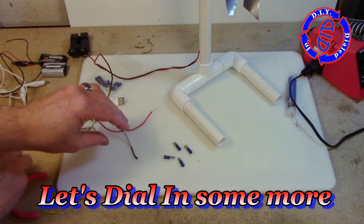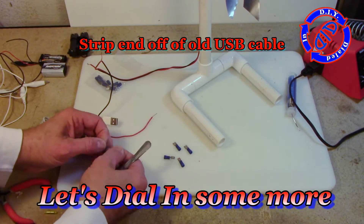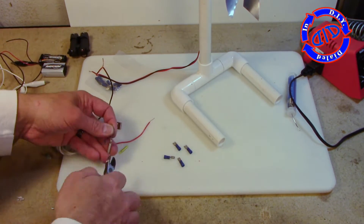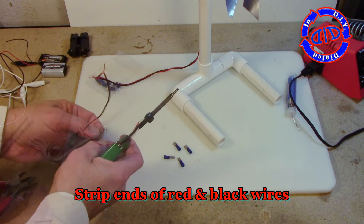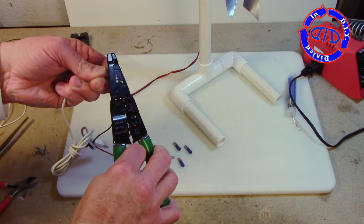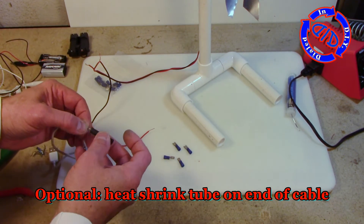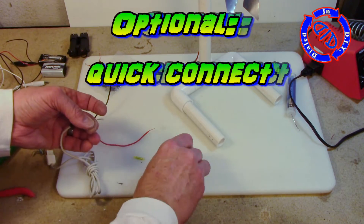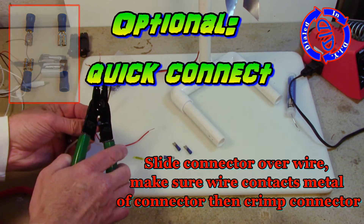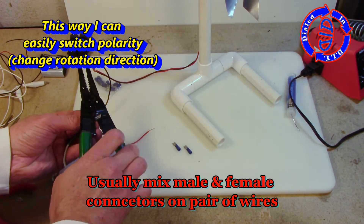I still think we can get more out of this build. While I want safe wiring, I also want the flexibility of using multiple power sources. Instead of just a battery pack, I'm taking this old worn-out USB cable, removing the sheathing off one end to get down to the four wires inside. The red and black wires are the primary power sources from a USB jack, and we're going to use those to hook up to our motor. I'm adding a piece of heat shrink tube before connecting the wires, or you can use electrical tape. Moving on, we'll use this optional quick connect system — you can just twist wires together if you prefer, but these work really well.